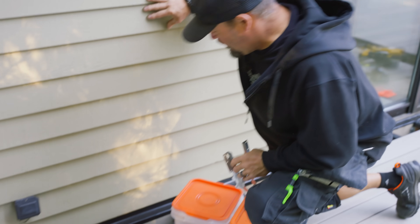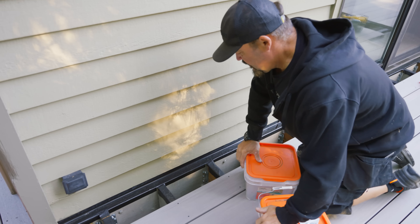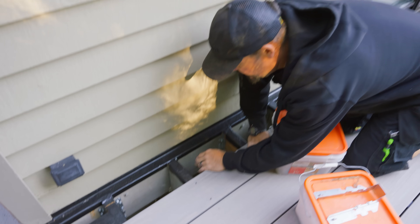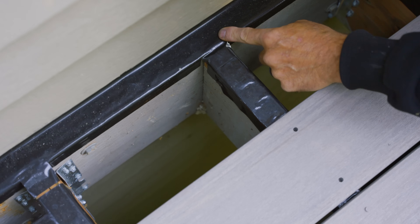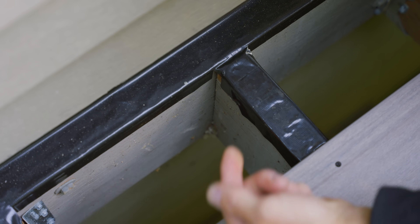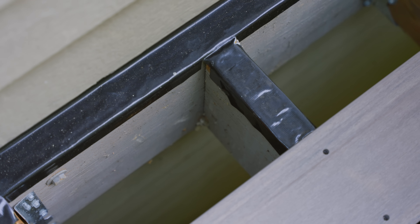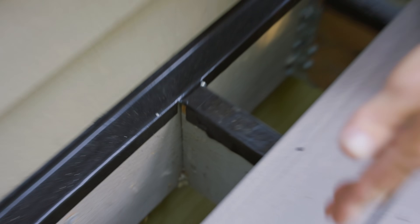We have this one spot on our deck — this was a remodel. We added framing to it, but the original framing did not have joist hangers on the joists attached to the ledger. We went through and added joist hangers to everything, but we just hadn't put one on this one yet. These are just toenailed to the wall, and that's not the proper way to install a joist. It's not safe, and that's a temporary fix. Even though there's a beam underneath holding this up, we still want to use a joist hanger to keep everything tied together.